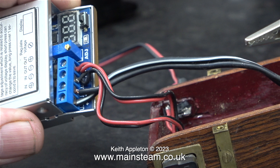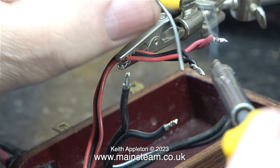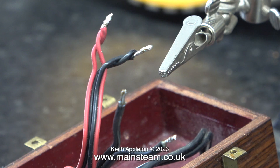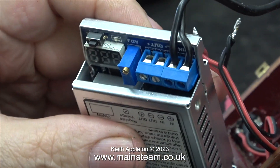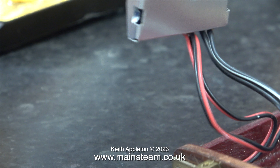The main power supply wires from the dynamo and the outlets that go to each of the plugs on the side of the box fit into the block connector on this regulator. But simply inserting unsoldered wires is not a good way of doing it — you can pull them out really easily. This is the way I would do it: I twist two pairs of wires together, and once again with the iron tinned, I apply the solder to the wire, not to the tip. If this resin core solder melts and flows, then everything's okay; if it doesn't, the joint isn't hot enough. After the soldering, I cut each of these pieces of wire to exactly the right length to fit into the connector and, with the help of a small screwdriver, fit them in place. I don't think these would come out of the block even if pulled hard — the block would probably break off the circuit board first. This should be a long lasting and very strong electrical connection.